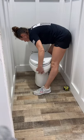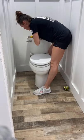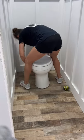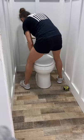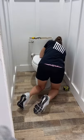Then it was time to install the toilet. You just pick up the toilet and set it evenly over the flange, making sure that the bolts go through the bolt holes on the toilet base. Make sure that toilet is positioned right where you want it. Give it a firm push so it smashes the wax, and then you're just going to tighten the bolts up.